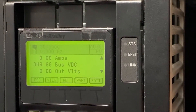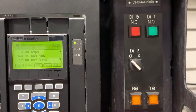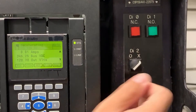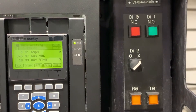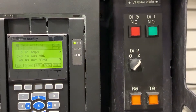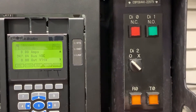And with that, we have our system set up. Now I'm going to press start. It says it's at reference. I'm going to dial up the potentiometer to halfway, and you can see that it's rising up to 30 hertz. I'm going to change direction. You can see that the direction is changing. I'm slowing back down to zero according to our ramp time, which defaults to 10 seconds. I'm now ramping up in the reverse direction up to 30 hertz. I'm going to stop, decelerating to zero according to our decel time, which is defaulted to 10 seconds. Until finally I stop, I'm going to change our direction back to forward, and lower my potentiometer back down to zero.